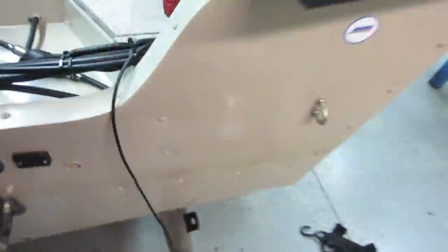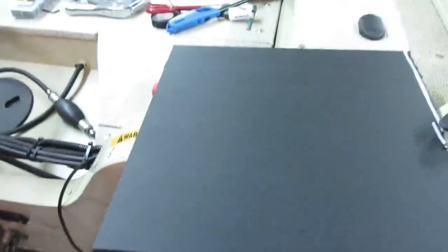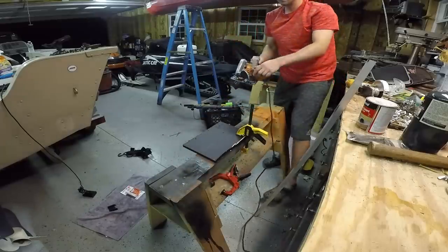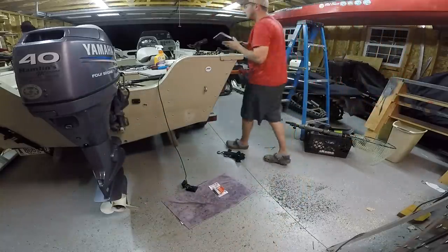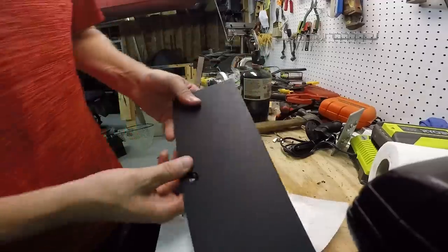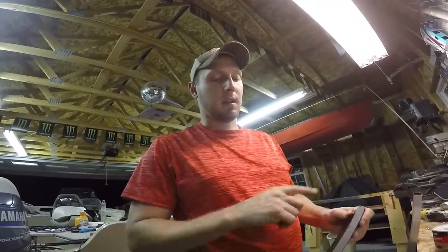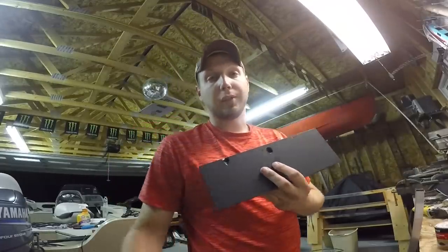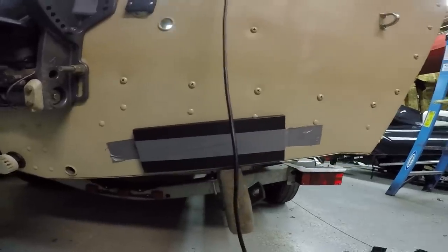What I'm going to do is cut the starboard right now using a circular saw to the width I want and check how it fits. I marked where the rivets hit the piece and countersunk a small hole for each rivet. Then I set it on there with some tape, outlined it with a pencil to see where it's going to sit. Two holes countersunk, and then we'll get some glue on there. That was pretty easy — mark it out and glue her on.